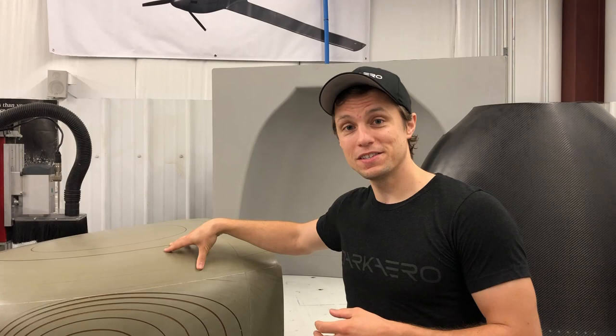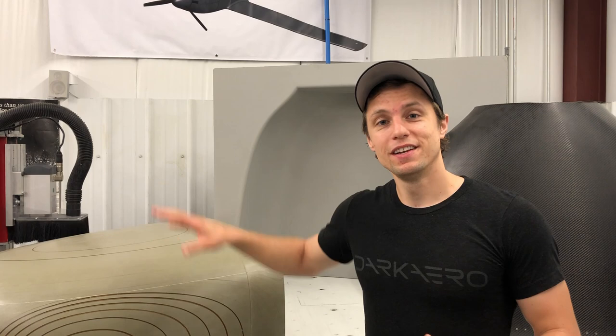As a side note, there are a lot of different materials you can use other than tooling board, and a lot of them we've tried. There's MDF, there's low density foam off the shelf from your local hardware store, and there's even 3D printing. Like I said, we've tried those, but they didn't fit the bill for the quality and long-term robustness that we wanted out of a plug.